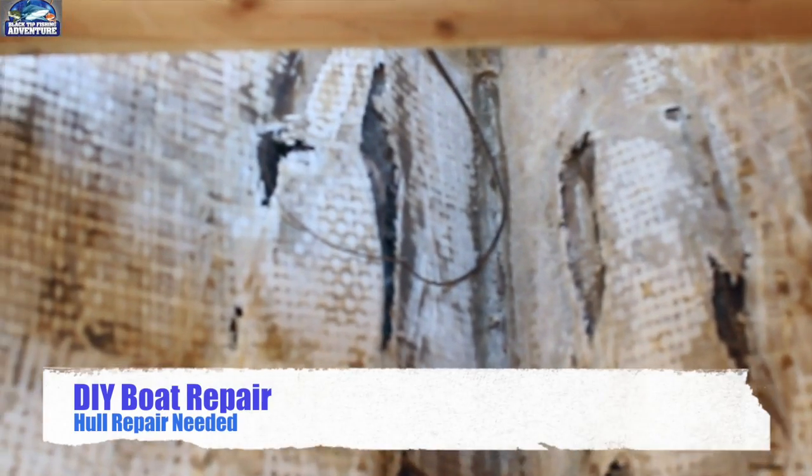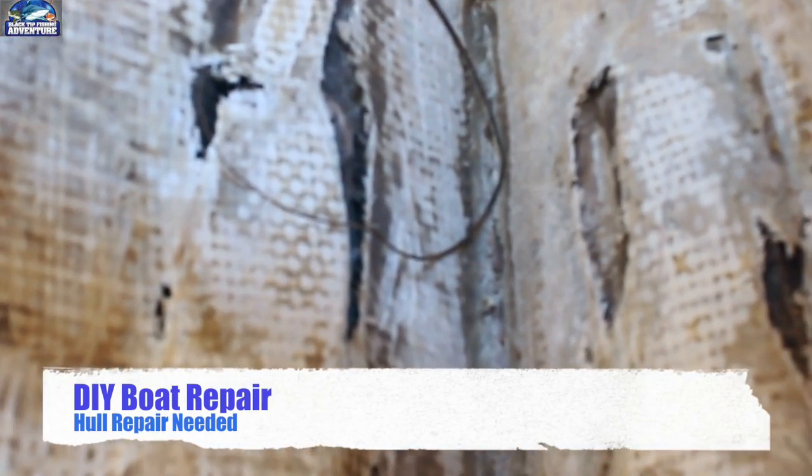When I was grinding yesterday, there's fiberglass on top of rotten wood. I'm actually gonna leave that because that wood acts as a support for the fiberglass, the frame of the hull. So I'm gonna leave that, just make sure that I cake the fiberglass in there pretty good and some matting off across in there.